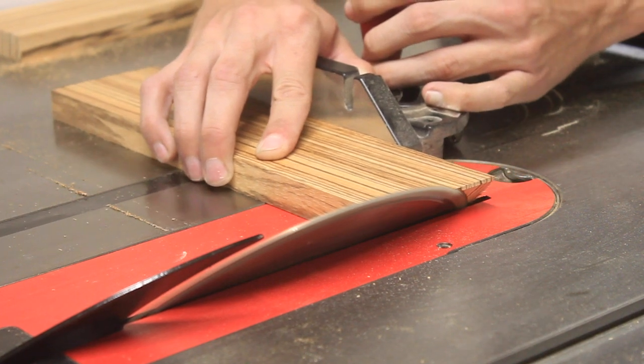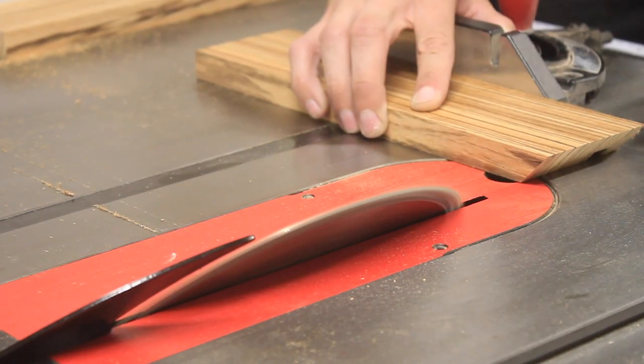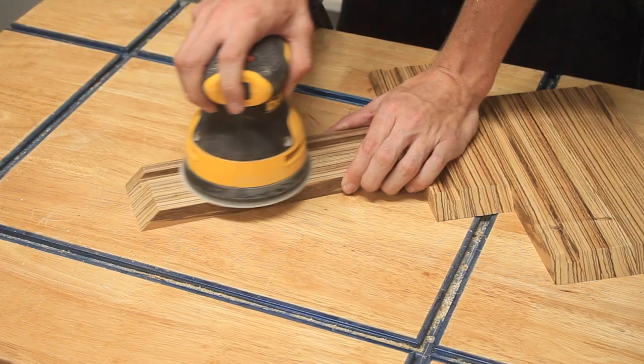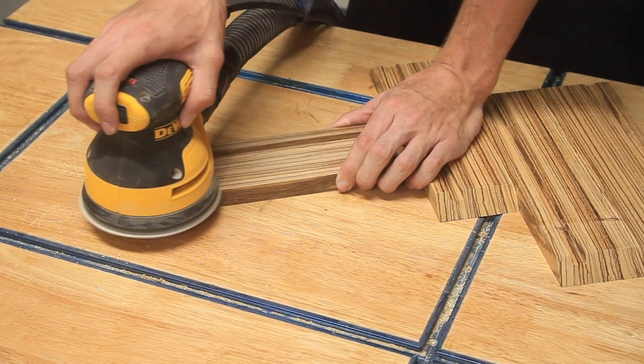The wrapped grain will work for three of the corners. The corner where the two ends of the board meet will be hidden on the backside. Next, I cut the bottom panel out of half-inch plywood. This will neatly fit into the dados you saw me cut earlier.